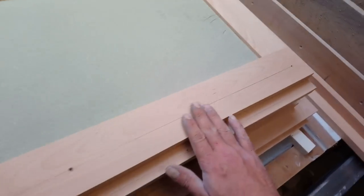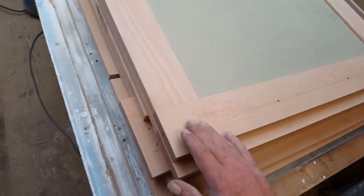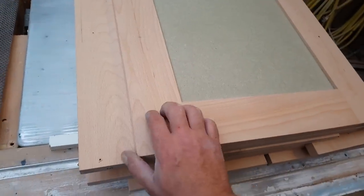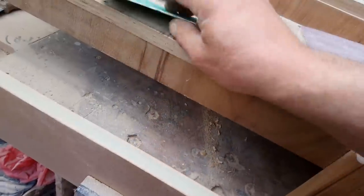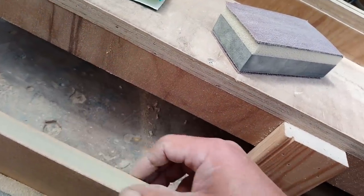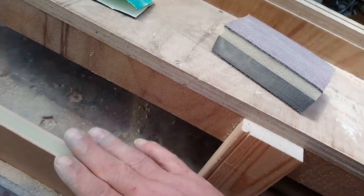Before I start painting, I'm just going to go around and make sure all the corners are knocked off, sanded round, some of these bits where the screws went in, just generally make sure they're ready. These two are the end panels for the tall unit. I'm sanding the edge of the MDF with 80 grit to get them smooth, then I'll take off the sharp corners and go over with 120 to get it smooth, and I'll leave it at that.